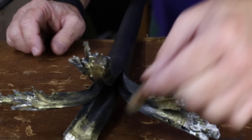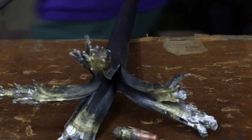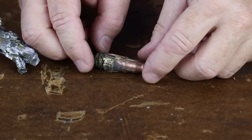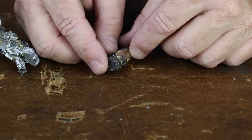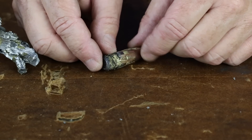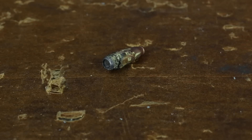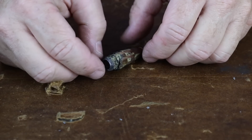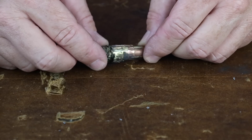Wow, this is cool. The nose got a little messed up — that was a byproduct of me beating the hell out of it with a steel rod. But look at the back end. It's just all shredded back there. Never seen a projectile like that. Never sent one down a bore with C4 behind it. It's really interesting that it only made it about eight or nine inches down the barrel, because the thing's ripping apart and dumping all the pressure out. You would have thought the initial momentum given by the blast would have been enough to keep it going, but it takes a fair amount of force to swage a piece of steel through a bore because it is slightly oversized.